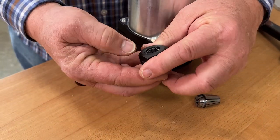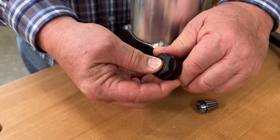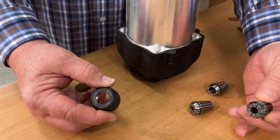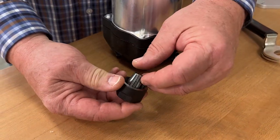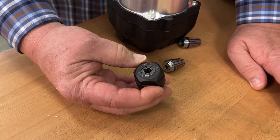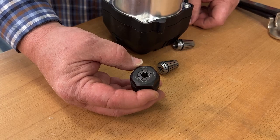There's the quarter, there's the half, and I have some European router bits that are eight millimeter — a little bit bigger than a quarter as you can see here. Those eight millimeter bits are really nice, and now I'm not limited to which routers I can run them in. I can run them in my Spinrite as well as my German routers.